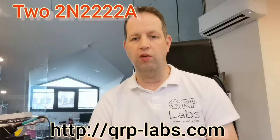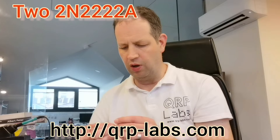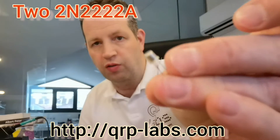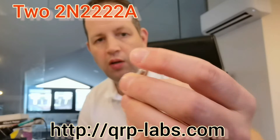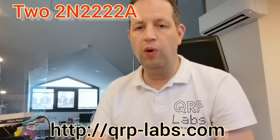So what is the 2N2222 challenge? This is a challenge set up by QRP FDIM where you basically have to get as much power output as you can from two 2N2222A transistors in their metal case. You have a continuous one-minute key down, and the competition entry is defined as the least power during that one minute, which is what happens at the end as the transistors heat up and get less efficient.